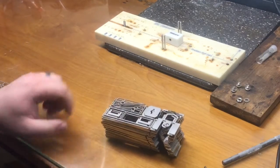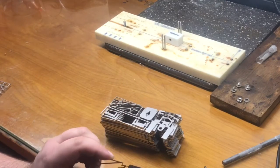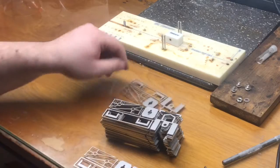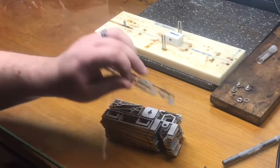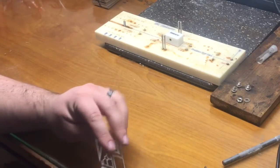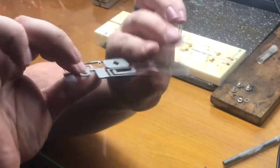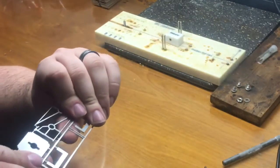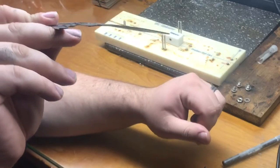I mean, the whole pile wobbles around a bit. A lot of it has to do with the slag that's still on it when they laser cut them. You can see right there off the pile, not one of these is really truly flat. Best thing that I've come to find out is kind of eyeball it like this and see how it, kind of exaggerating a bend. However, you can see just how easily they do bend, and I've had a stack of 2 or 3 of them come back to me that were bent like that, and returned.